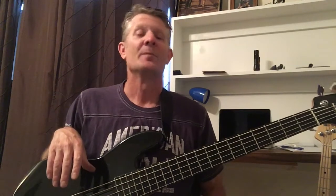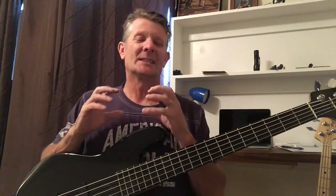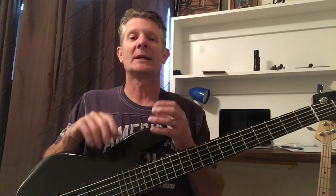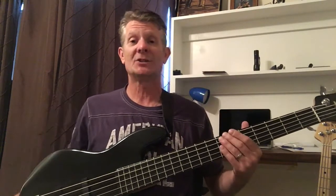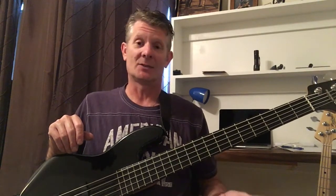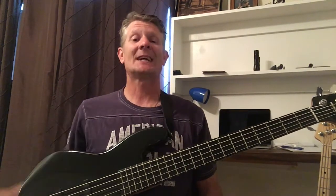Use a speaker cable. And if you don't know the difference, the gauge wire of a speaker cable is a little bigger. You can look at it and tell, it's a little bigger than an instrument cable, but it's real close. So if you don't recognize that, another way to look at it is to check the label. All of these cables are labeled. Instrument cable is only for your instrument, your guitars, your bass, your quarter-inch jack, and that's why they're similar. The speaker cable has a quarter-inch jack and your instrument cable has a quarter-inch jack, so they look similar, but they are different. So it is imperative that you use a speaker cable, not an instrument cable. Check it out. I'll wait.